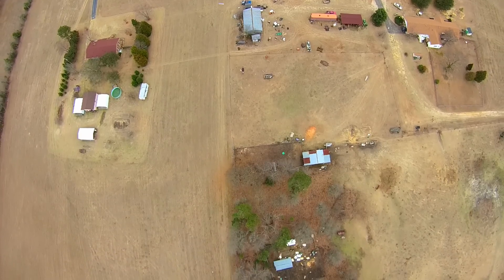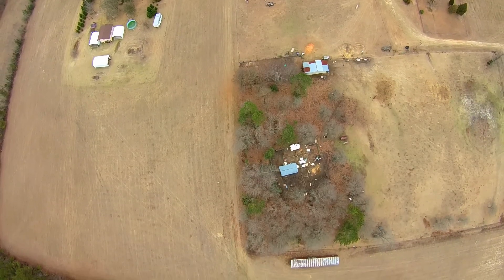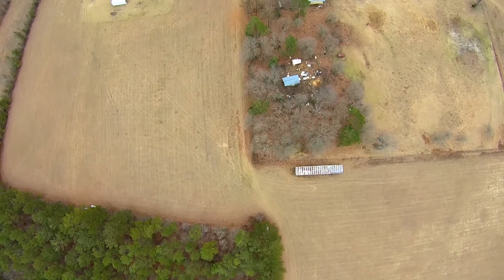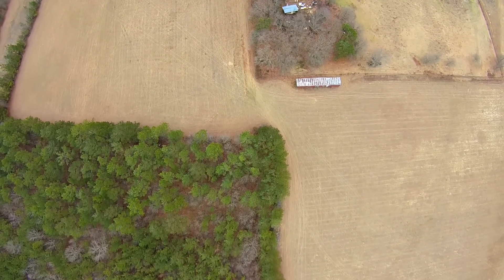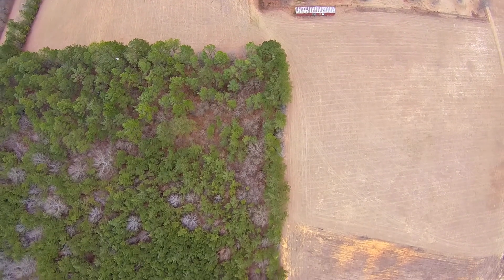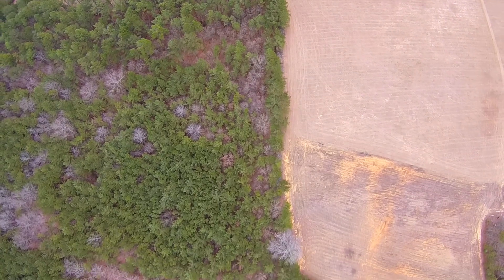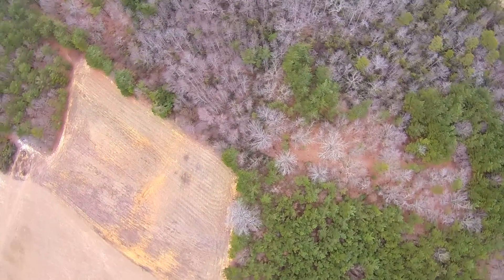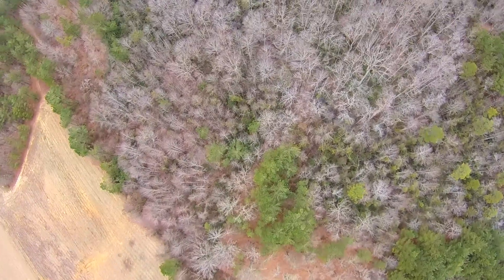One thing I've noticed when flying the Q500 and the ST-10: if you're flying and you lose video momentarily for a few seconds, as long as you reacquire it fairly quickly, the video will come right back. But if you sit out of range for a significant period of time, it takes a while for the camera and the ST-10 to reconnect. I started bringing it back and it ended up reconnecting at about 600 feet distance.